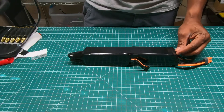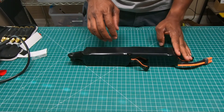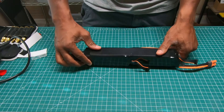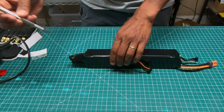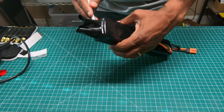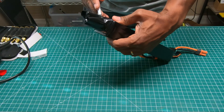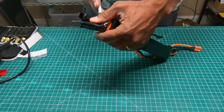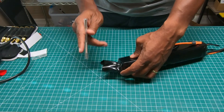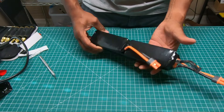That's pretty much it. I don't want to put too much on the front, but I want that little lip to be down — there it goes, nice and easy. Now I can take my trusty X-Acto knife and cut the back. That's why I don't put so much shrink wrap on the front part, because you don't want to trust yourself with an X-Acto knife up around the battery leads — so I'd rather trim it in the back. And there you have it.